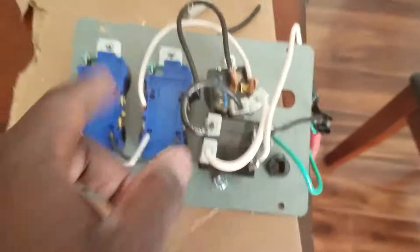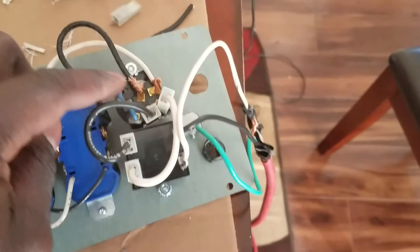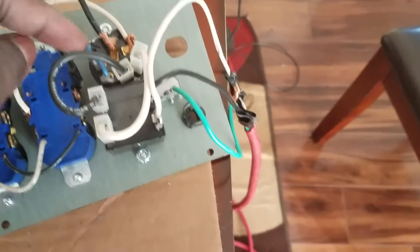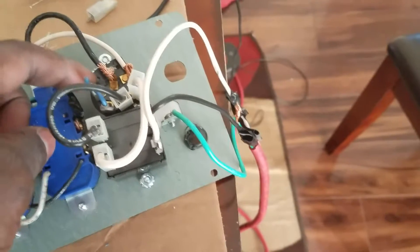I'm going backwards — I'm going forward. I got my main switch, which is taking the power in, which is this main cord here. I'm going to make it look clean, I just wanted to test it all out. This is my positive, which is my hot line, and my negative and my ground. They're going into this solenoid here. From there, they come out of the solenoid and they go to the actuator switch, which is that on and off switch. That on and off switch has the remote switch, which is this blue little line here. And it has the hot and negative line. You need this to be connected so it can give you the automatic signal to turn it on. I guess this is a three-phase system, so you need this remote switch on there. So I got the positive and negative going there.